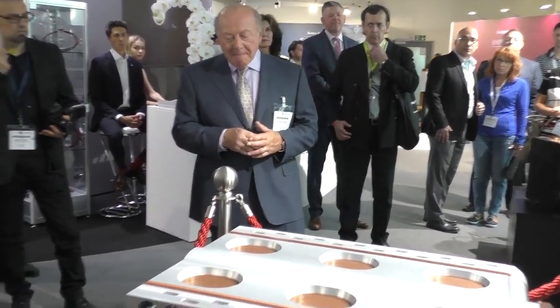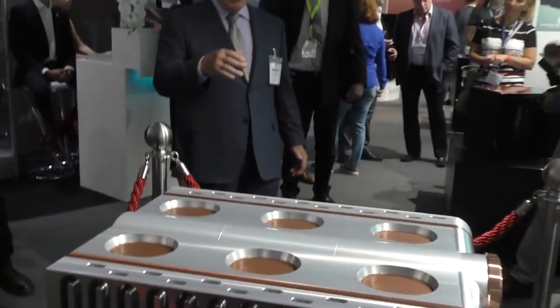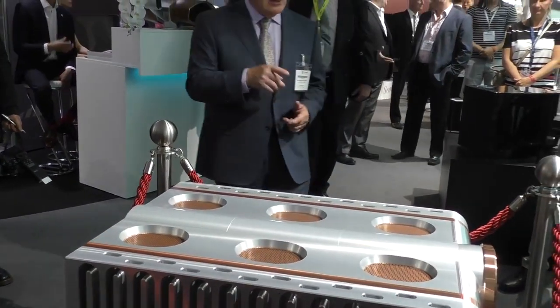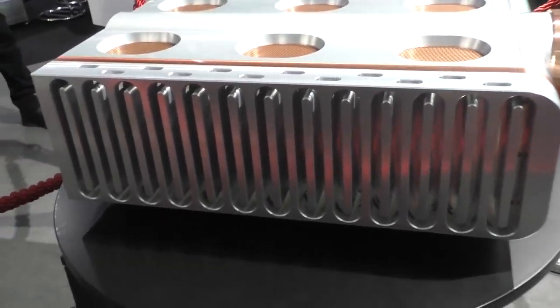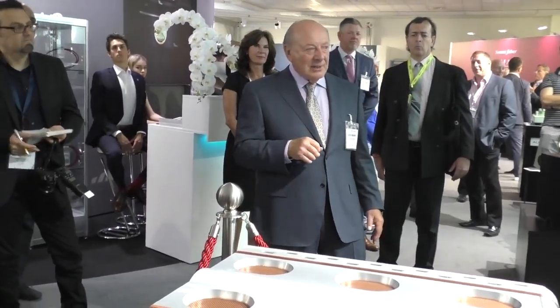Going to the mechanical design, we used copper in the Momentum. I wanted to make a statement with that because copper is a very important part of the Momentum. In the Relentless, I use copper differently. I turned it into a heat engine. The copper gets warm, and the heat sink on the outside gets rid of the heat. We took the Venturi effect that we have in the Momentum heat sink and made it into a more complicated Venturi for the outsides of this mechanical heat sink. So this thermal engine, as I like to call it, is constant. It gets to one temperature and almost never changes. I've had them in my house on for 2 weeks and played them at crazy levels and low levels, and they're always the same temperature. They rarely rise in temperature. That's a very important thing.